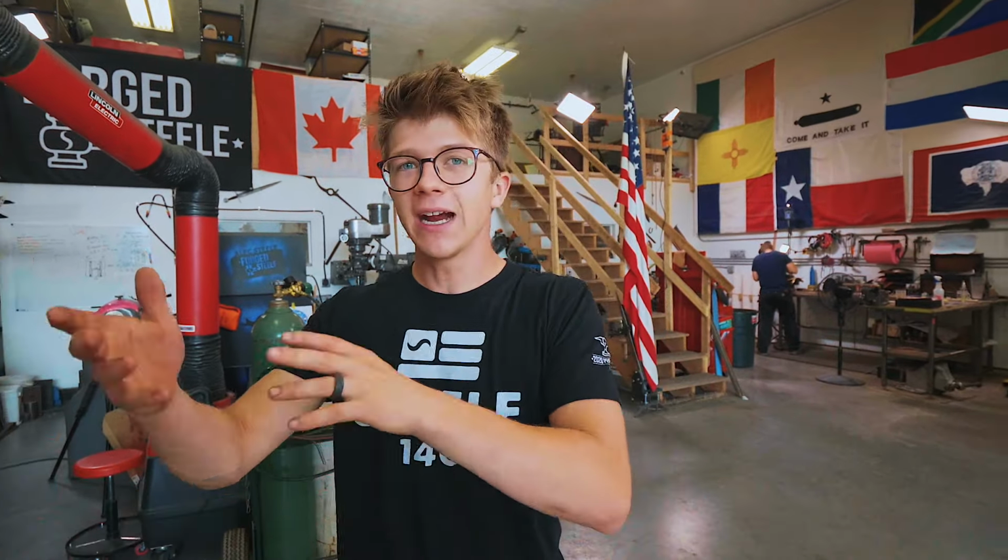On just exposing those raw innards, we peeled off a whole lot of the outside. There were some bits that didn't peel off, so I went to the grinding room. We'd been grinding on it. I felt like I ground through all of the remaining mild steel and stainless foil jacket, but what I'm now going to do is prove this pudding by putting it in the forge, and now I'm gonna forge on it again. And in forging on it again, we're gonna see if stuff breaks off. If it does, we'll be able to grind through it and then keep forging.